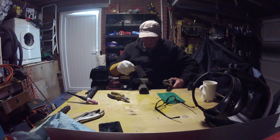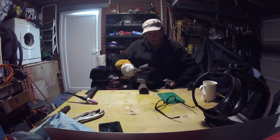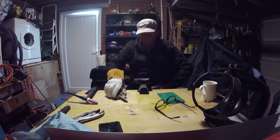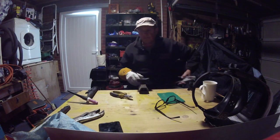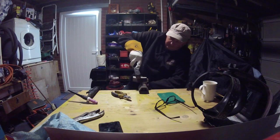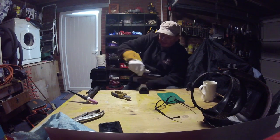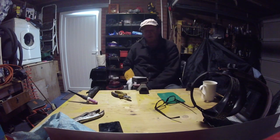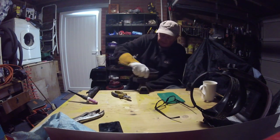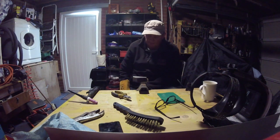Still feels like the first one was probably better. It's pretty hot. The plate's getting hotter as we go. Let's try something else and get a bit cleaner. Obviously your work's got to be really clean. In real life I just want to be welding some plates and get something done — I don't want to mess about all day, I ain't got the patience for that to be honest. You ain't going to weld through rust like you can with a stick or MIG.